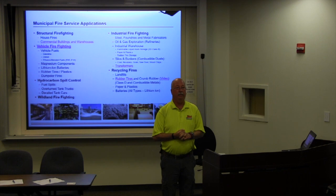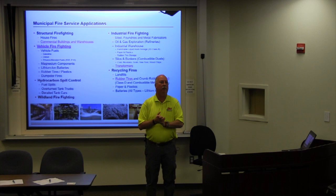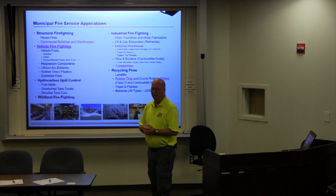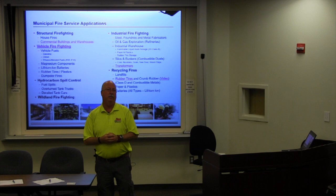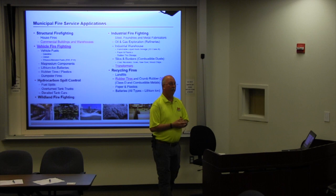With a 1% concentration of F-500, I'll get the chief a video of a test that was done in California where they sprayed a room of a hotel that they were getting ready to burn, and some telephone poles. He can put it up and let everybody view it, but I believe it's on our website. They had a telephone pole that they treated, and after about 45 minutes with flame impingement and heat in excess of 1500 degrees, the telephone pole still isn't burning. So we can give you really good burn-back resistance, and we can take some of your exposures out of the equation.